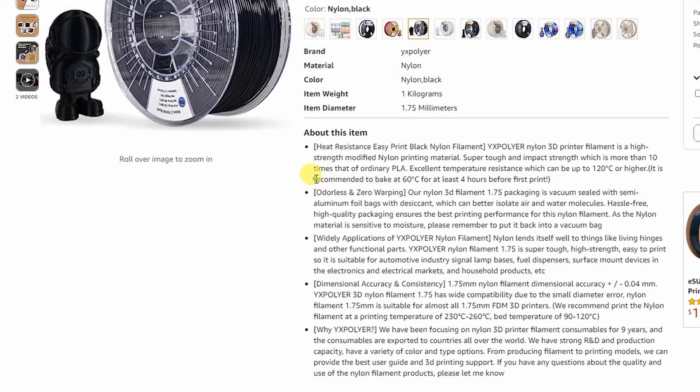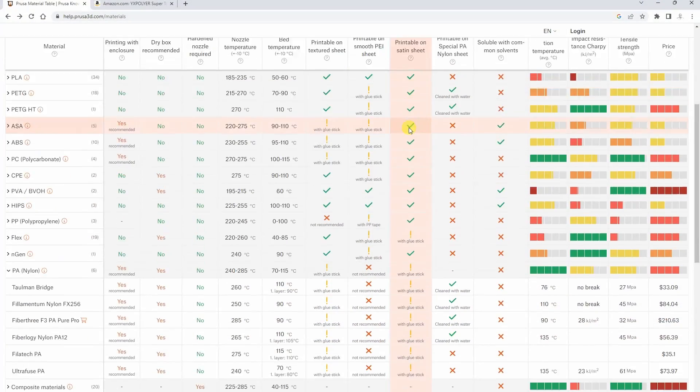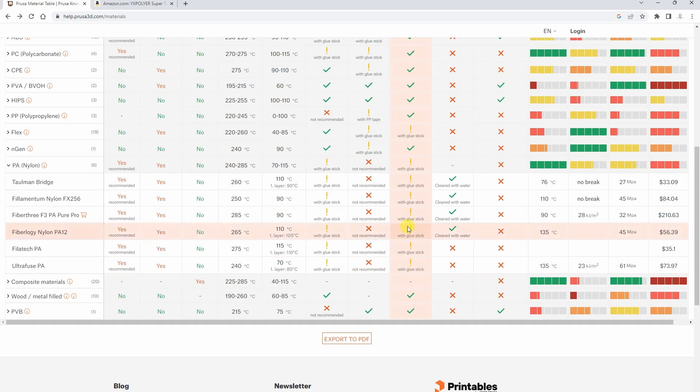They have the warning that we have to dry it for hours at 60 degrees Celsius before the start. I would like to see more specifications out of the box, so maybe I will dry it one hour, but the printing will definitely be from the filament dryer too. I'm not sure which printer and build surface to try — probably the MK3S with a satin sheet using the glue stick, following Prusa's material guide table.